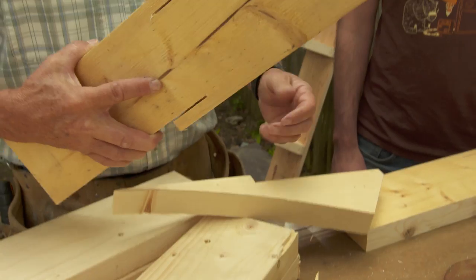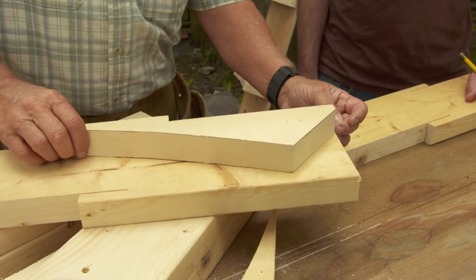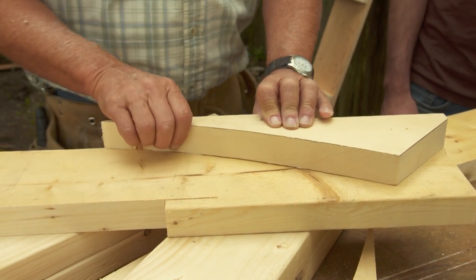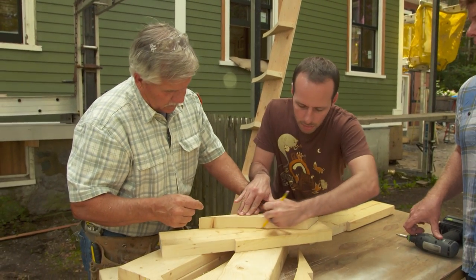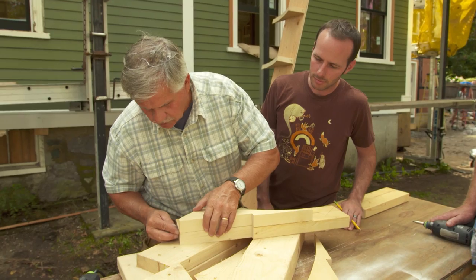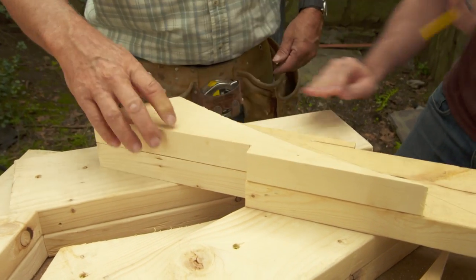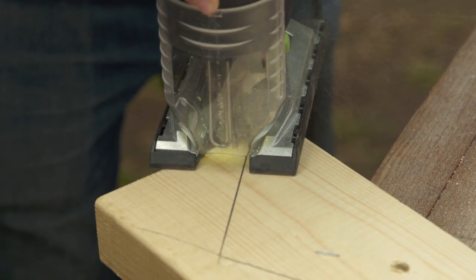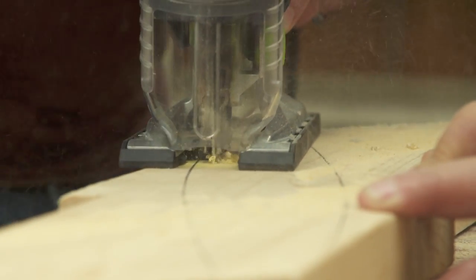We've made a template with the back cut out where it will mount to the plywood. Hold the template flush on top, even on the back where the plywood goes, and even on the bottom edge that goes against the house. Holding it tight, mark it. The template has a notch on one side so you can flip it to mark the other side — flush on the back, in both areas, and even on the top. Cut with a jigsaw, staying about a quarter inch away from the line for a rough cut. When cutting with a jigsaw, hold the plate flat on the table and put downward pressure on it.